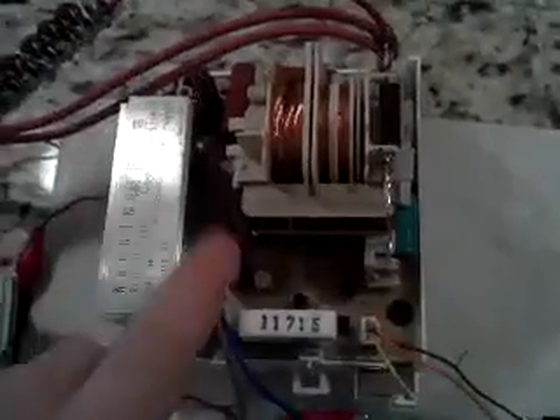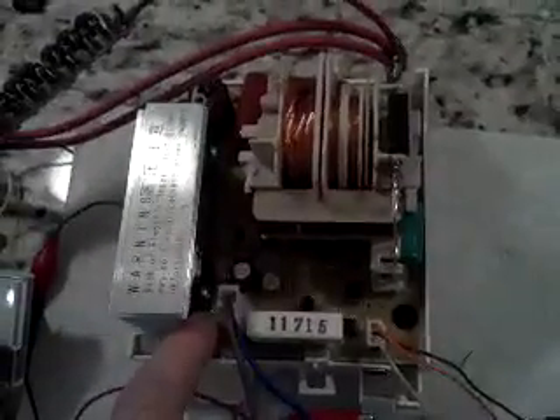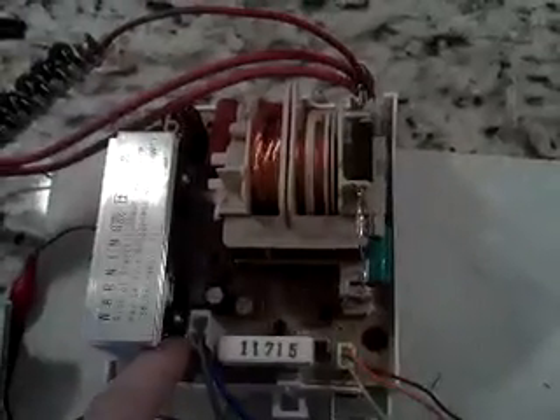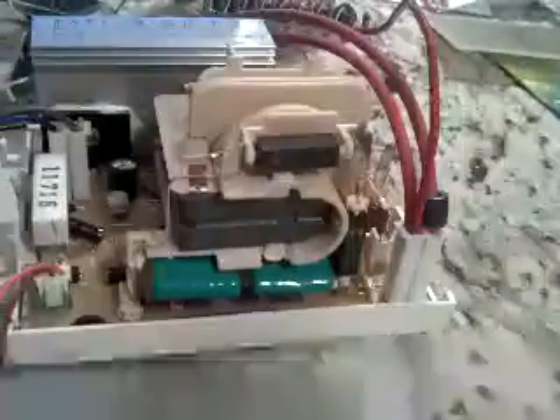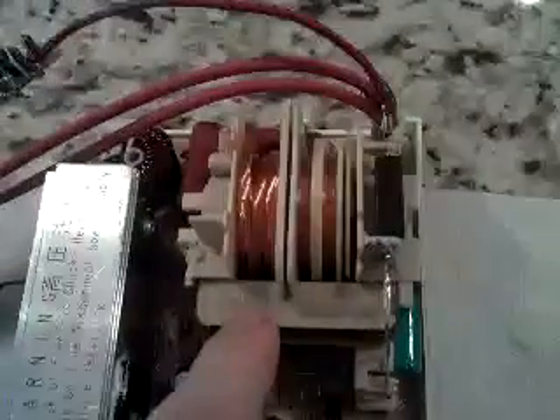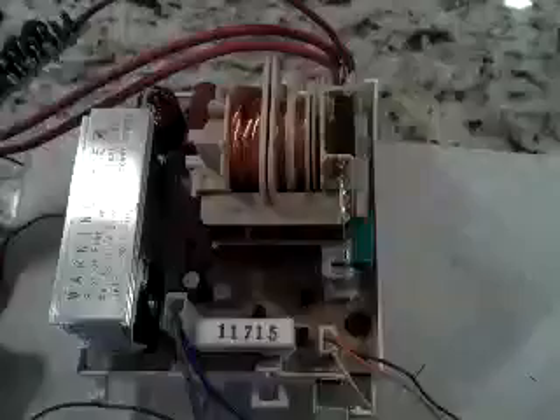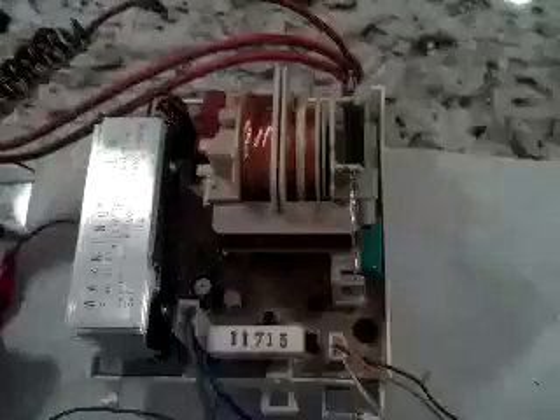You can probably achieve a smoothed output by putting a filter capacitance on the DC bus after this bridge rectifier. I haven't tried that yet, but that should work just fine. And it may be possible to reconfigure this for a positive high voltage output by reconfiguring the diode and capacitor array on the output of the transformer. I haven't done that yet, but I think it may be necessary to switch the winding output leads as well, because if this converter operates in flyback mode, then the output is not true AC — it's a DC pulse stream. Simply reversing the connection of the diodes will not result in very good output and could potentially damage the inverter. So I intend to follow up once I have those issues resolved. In the meantime, happy hacking, be safe, and enjoy!